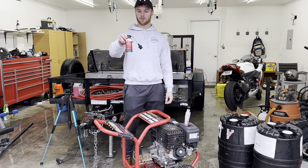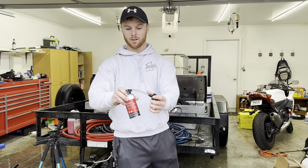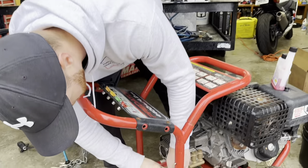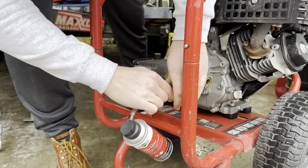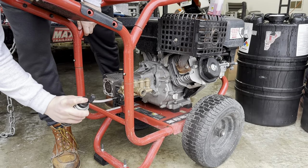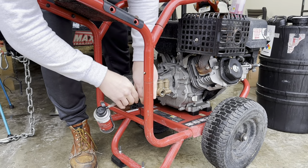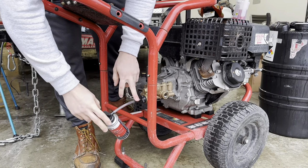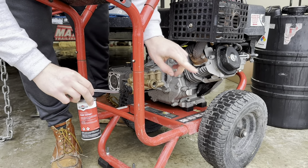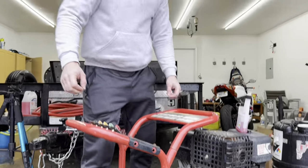They have this Pump Saver from Lowe's — you can also find it at Home Depot or most hardware stores. What this does is screw right into your pump inlet, then you just squeeze the top of the can. It's an antifreeze and pump lubricant, so it runs through your pump and out the outlet. You should see antifreeze and any water left in the pump coming out of the outlet.